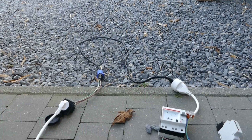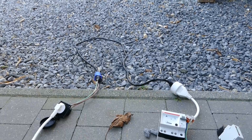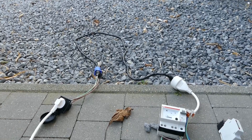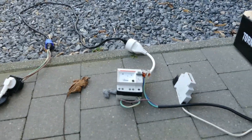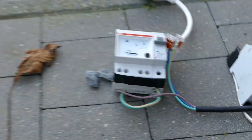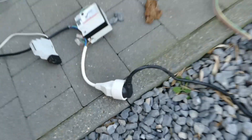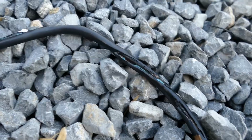The cable failed and the breaker did its work and it popped. What actually happened is that the shielding melted, two wires touched each other, and it caused a complete short circuit. This exceeded the current of the breaker which made it trip. Let's unplug it and let it cool down for a bit, and then we can have a look at what this cable suffered during this test, because it isn't looking very good.